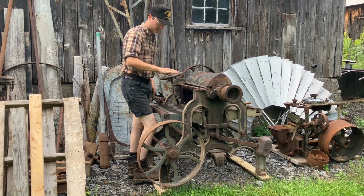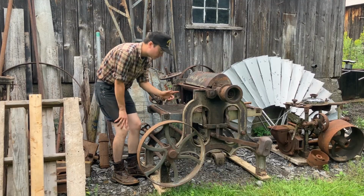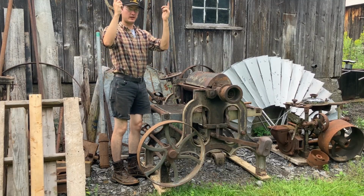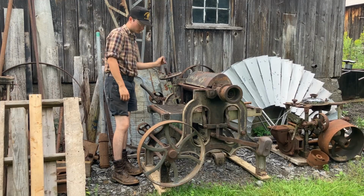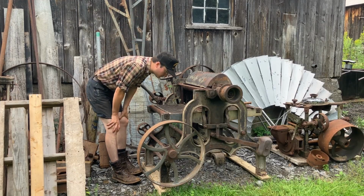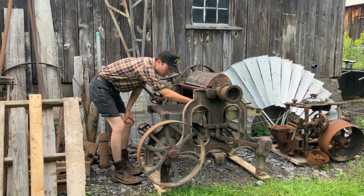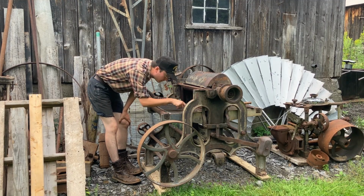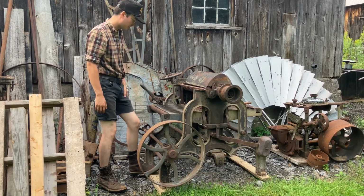So, last thing to do with this planer is the table isn't seized with regards to up and down. The ways are fine, but the screws, there's two worms on either side that go up to raise and lower the table in conjunction with this handle here, and they are seized in place. So like I mentioned before, diesel there, the one's gone through, so this side might be freed up, but this one's going to be needing a little bit more tinkering.